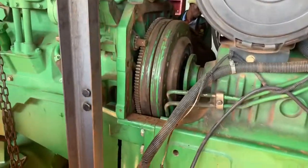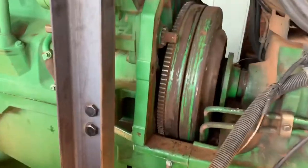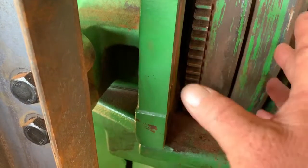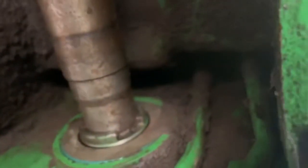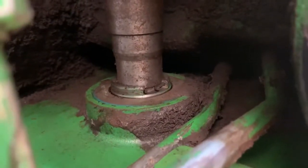Just for reference sake, there are 2 sneaky bolts when taking off 8000 series motors. Behind here there is a separate carrier unit for the main seal at the back. It sits right in here. That's an aluminium casing which ties onto the block, and the seal goes into the aluminium casing. That, however, is held on down here. There are 2 bolts inside there. Don't know if you can see them. Well, it's a bit dirty right now, but yeah, they are snuck right under there. Make sure you get those, otherwise you'll strip the thread right out of that aluminium casing once you try and take it out. Other than that, nothing special that I know of.